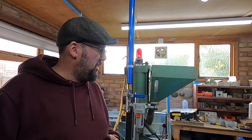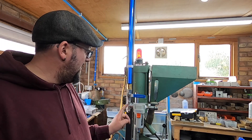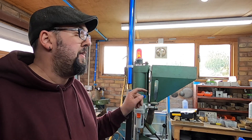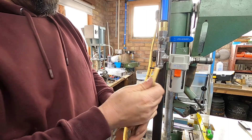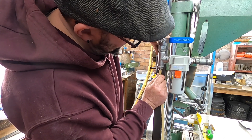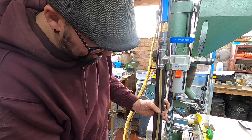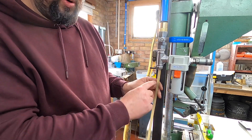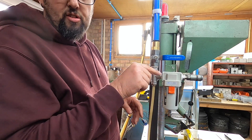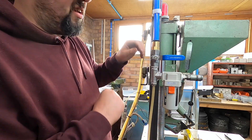All good news so far, I'm quite chuffed. So we'll get that pipe connected to the machine. We'll test these joints here which I think are going to be fine, and I've got something we can try in there and see if it's leaking. So we'll put the 10mm in here - just like that. We'll run it down there, I'll get some clips and we'll run it down the box. And this now can go to the machine. I've connected that pipe to the machine. The machine isolator at the back's turned off, but it'll pressurise this section when we turn this valve on.